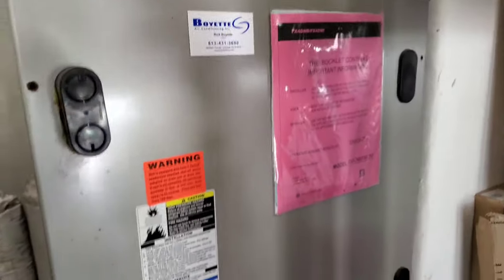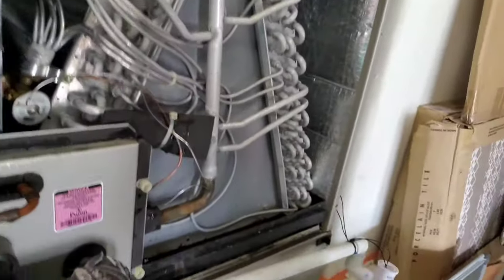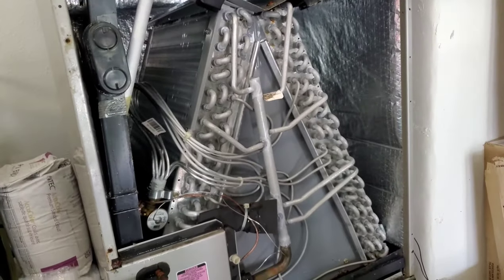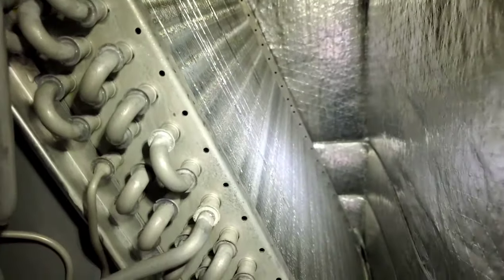For this unit we have removed all six screws — eight millimeter — and now let's go ahead and pull this panel off. What we're looking at here are the coils. If the coils are dirty, you may notice that an HVAC technician has applied solution on here to get any ice and dirt off. On visual inspection here, we can see the coils are pretty clean — there's no icing, all the lines are clean, and there's some basic condensation, which is normal. This is where the condensation comes from for those who haven't seen it.